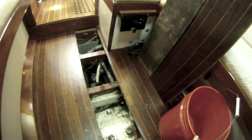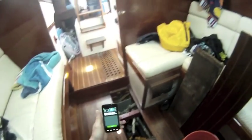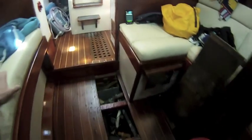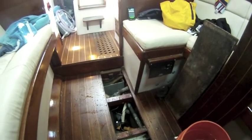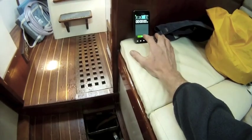Now I'm going to add a known quantity of water. I'm going to add exactly 5 gallons from this 5-gallon bucket. I've got my stopwatch here already. The reason we're doing that is because the gallons per minute that you see on the packets are in very ideal situations. You have the lift and how much hose you have to contend with and all things like this. So let's see how long it takes to pump out 5 gallons. Let's start.